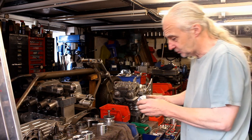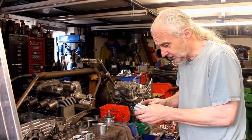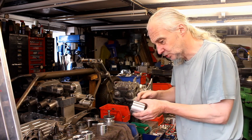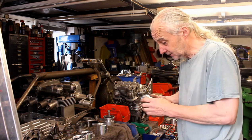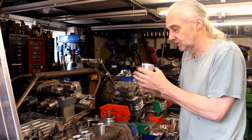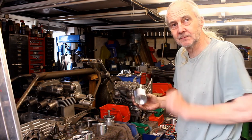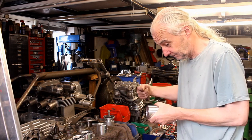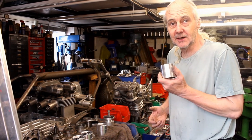Well, if you're trying to take out that much material in one go, even when you're parting, the tool can drift. And if you've got something small, you've only got to get it snagging, and it can snap. So you think it's a safer route? What I'd like to do is remove 90% of the metal with a slit saw and then make a tiny little cutter and polish it off in thousandths on the lathe. Don't get me wrong, some of these factories have all this equipment and they just go for it. Well, you haven't got that. I haven't got the luxury of wrecking that. No, of course not.